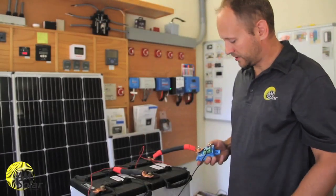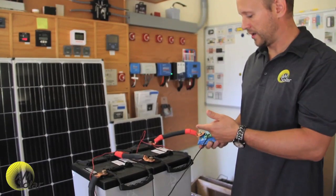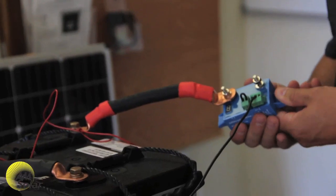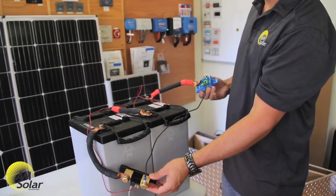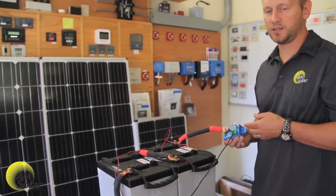For this demonstration I've connected a BP-65 to our battery bank. The IN terminal goes to the positive of the battery, and this terminal block — which already has the black cable in it — goes to the load side of the shunt. This configuration would be for battery protect mode in a DC distribution kit.